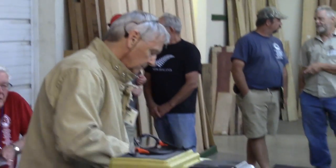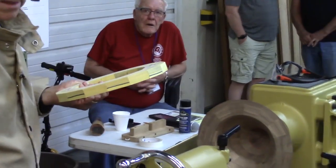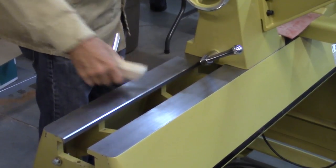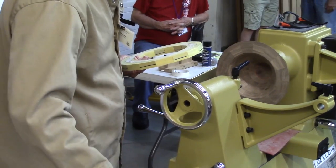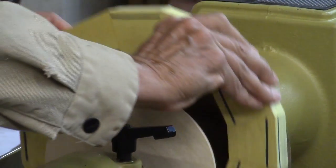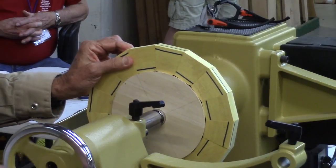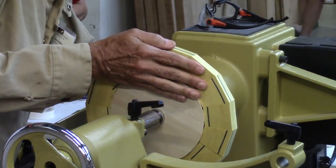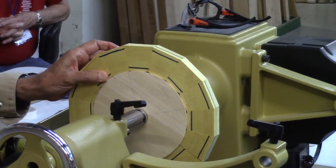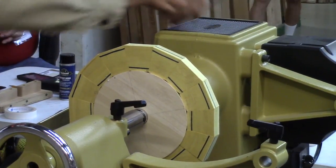I'm going to spread it out a little bit. We're going to come in with a little piece of silicone since it's somebody else's lathe, and a cheapy cone center you've made yourself with an old live center. With a fairly modest pressure, line this thing up, split the difference between those joints so you've centered it. We have about an inch-wide glue joint — it's got lots of strength and will be strong enough to turn in about 30 minutes.